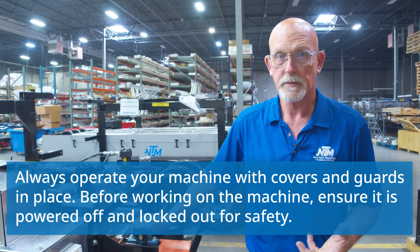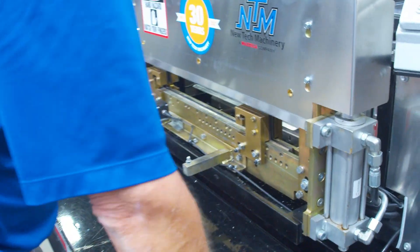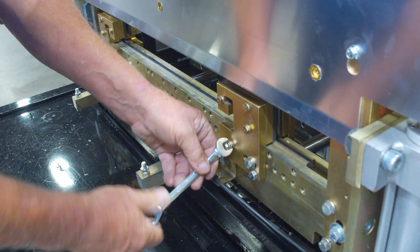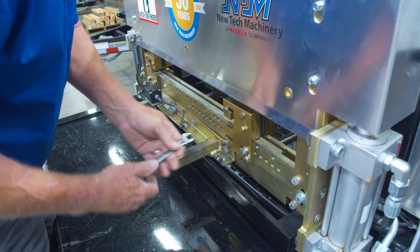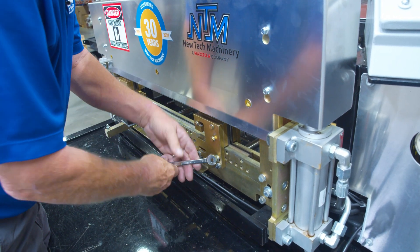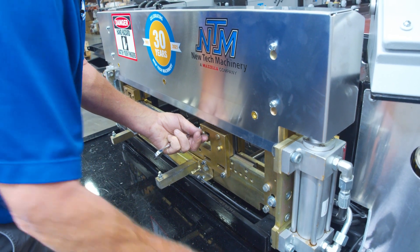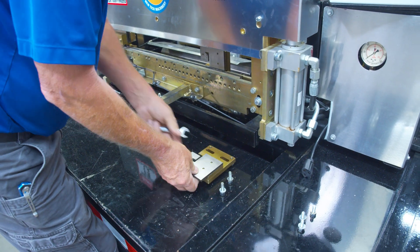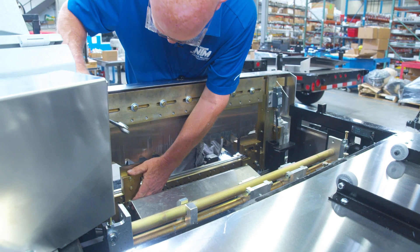The first thing I like to do is go to the exit of the machine and remove the shear die. The right side stays the same on the machine all the way through on your width changes — we're only changing the left side. I always do the dies first because I never like to do it last in case we forget. I've had people say they've crashed it, so just to make sure we cover that, we take them off while I am right here on the tailgate. First thing to take off, last thing to put back on.